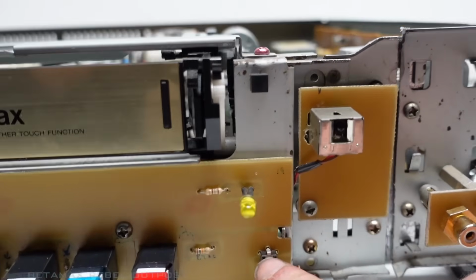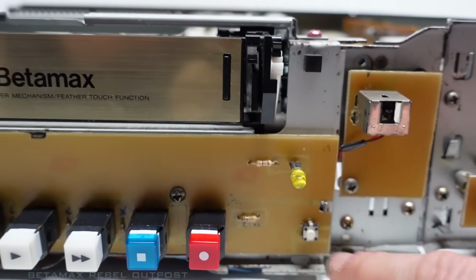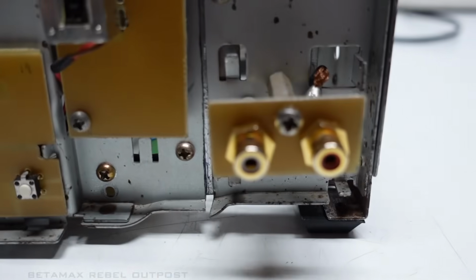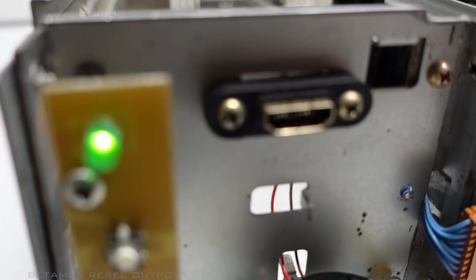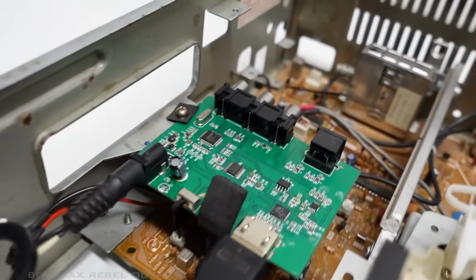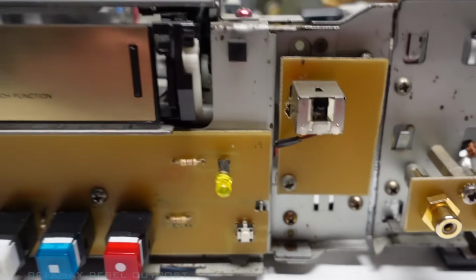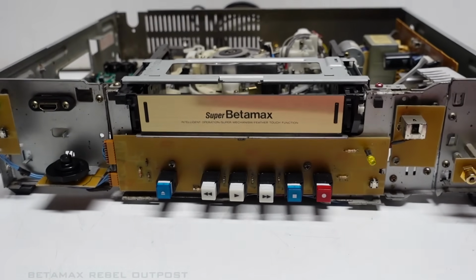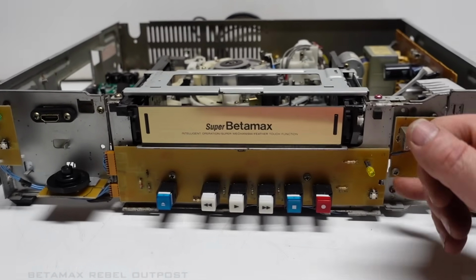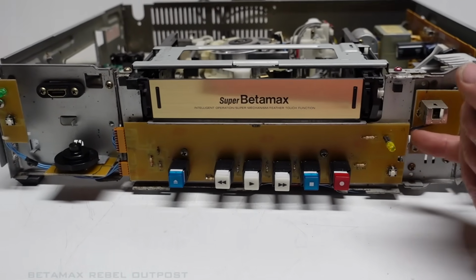The VTR switch is going to be repurposed to activate a video switch to select between the analog composite AV inputs or the HDMI input, which is just going to be converted to composite video. A lot of this is going to change. Nothing is quite set. There is going to be an anodized front panel I'm going to add to this. I'm going to redo the PCB. I'm going to get it actually printed.